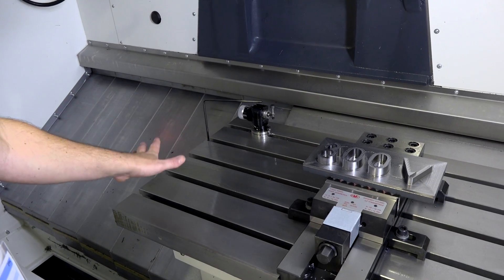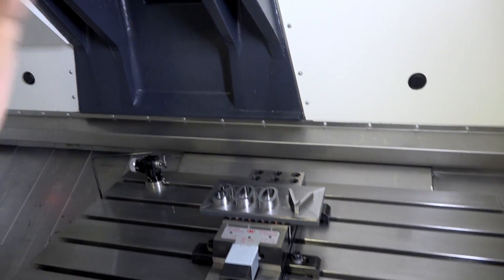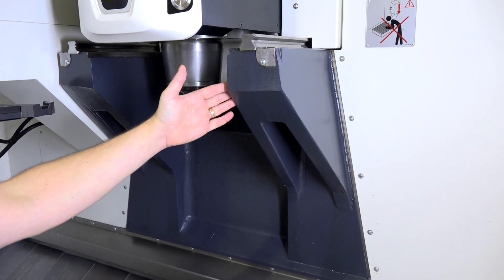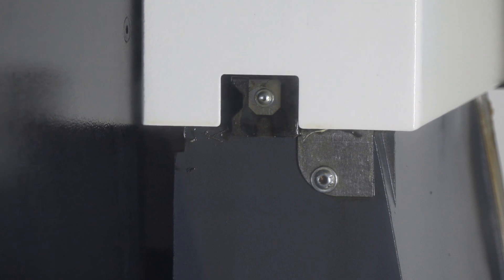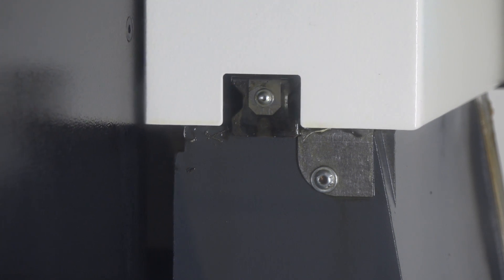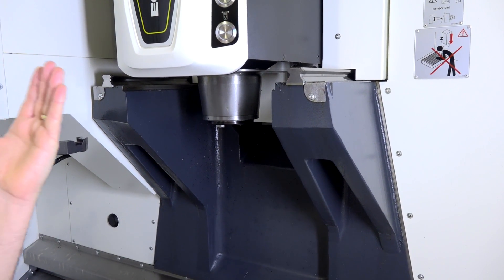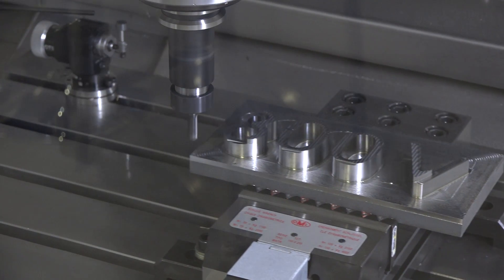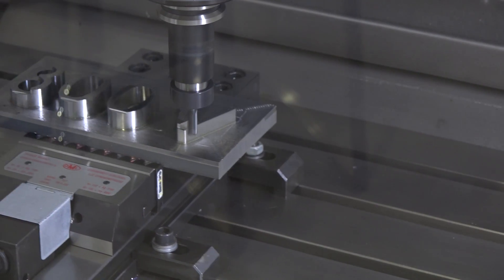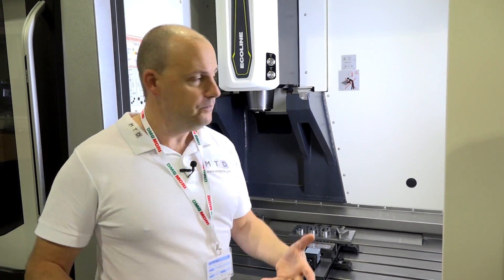None of that hazardous clogging of swarf — it all falls into the bottom of the machine. That's how your x-axis operates. For the y-axis, this is very impressive: DMG Mori have an extended gantry where the y-axis operates from the back of the column. This gives you plenty of rigidity even when the y-axis is at its furthest point, and it also means you can get a bigger y-axis travel in a smaller working envelope.